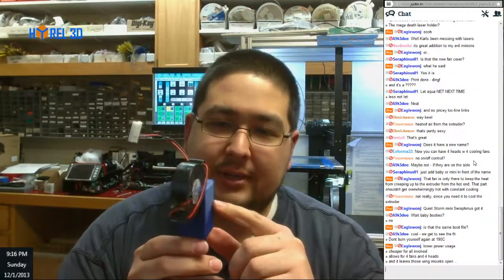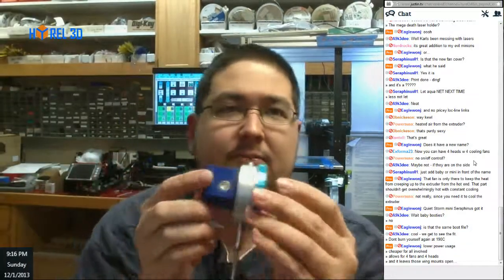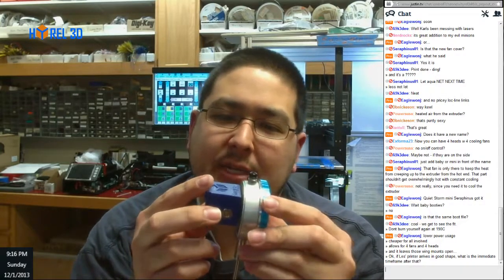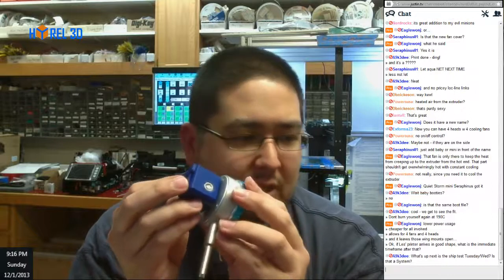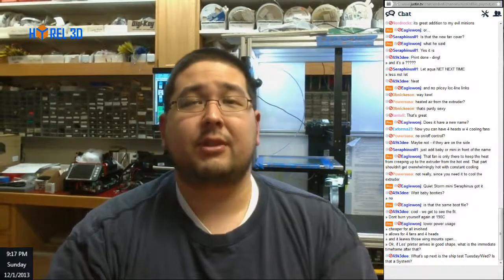Oh yeah, I did change one more thing to this guy. Oh, but Carl already sealed it up. I'm not sure if you can see this on the inside. There's a captured nut in there. I was able to actually get this guy to embed in there. You would be surprised. We were able to melt this particular nut into the plastic quite easily, and we were able to get him to seal in quite nicely. Nice, quick, simple, and easy. 5 seconds in a butane torch, then using some needle nose pliers and the table to press it in. Works great. That was another thing we haven't shared yet with anybody. So good stuff.